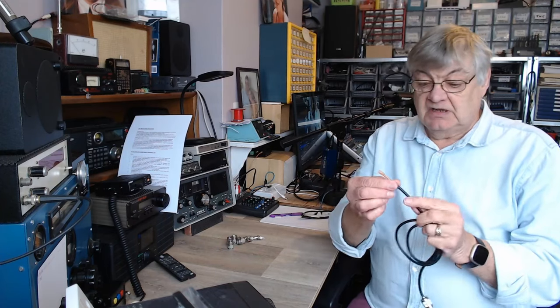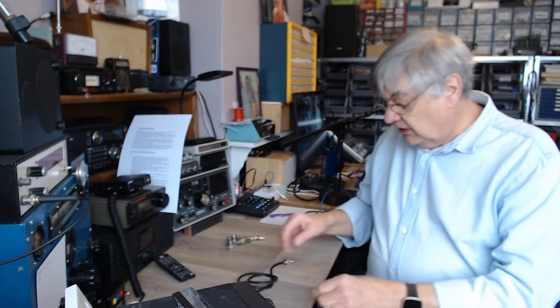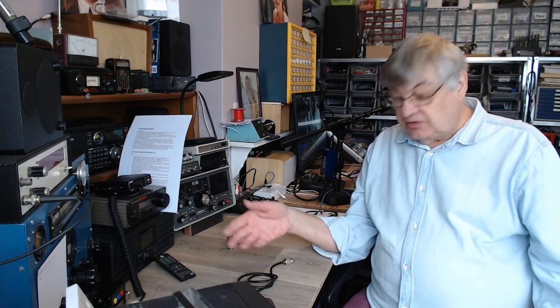Out in the garden where the coax runs to the aerial, it can act as an aerial itself — the inner can pick up EMI. Another problem is that it can also radiate electromagnetic interference through the not-so-well-screened braid. Here's a picture of the RG-214 — look at those two screens, both very close-weave and silver-plated. It's almost as good as a solid copper pipe, nearing 100% shielding. I'd always thought the double shield was about loss — but apparently it's mainly about EMI.